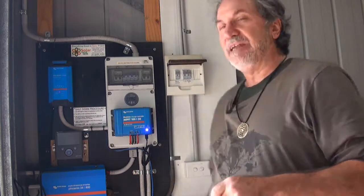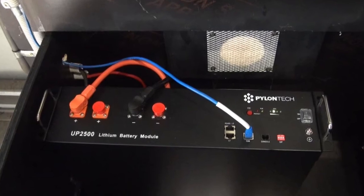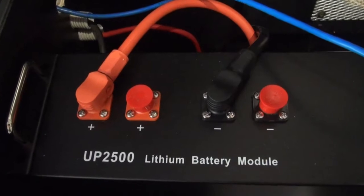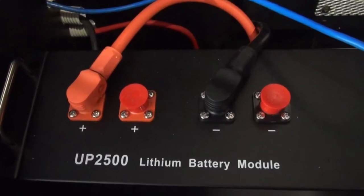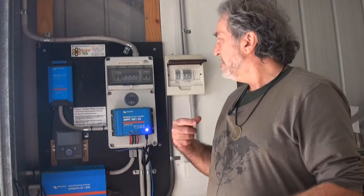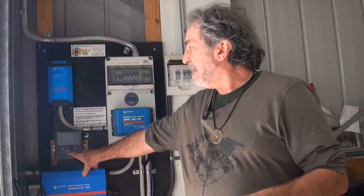This place had no power at all when I came. So what we did was replace the 24-volt lead-acid batteries with a Pylontech lithium — it's a 2.5 kilowatt-hour battery. It has a 10-year warranty and slots straight into the same system. We're lucky here because we had all Victron gear to start with, so it was all compatible with Pylontech.